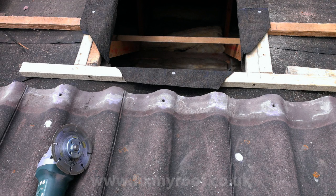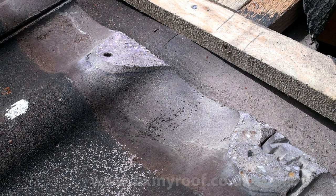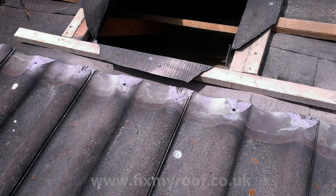Replace any insulation as necessary. If you have tiles with large profiles like these, it's a good idea to cut off the very tops of the tile where the flashings will sit later. This will stop the flashing kicking into the air, which can make the flashings leak on a moderate shallow pitch — not to mention it looks smarter as well.